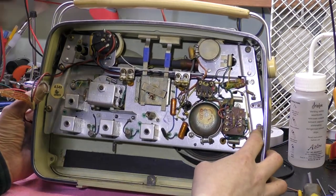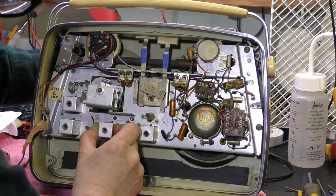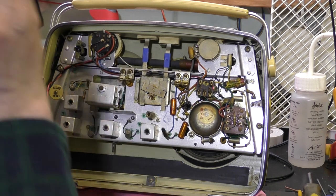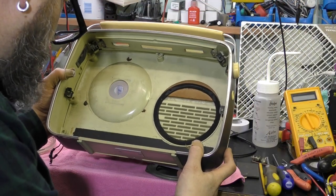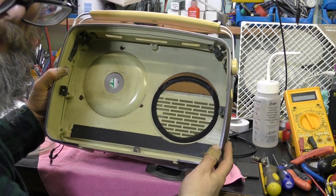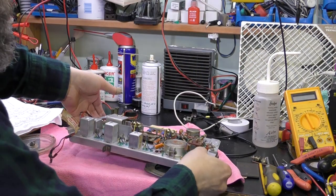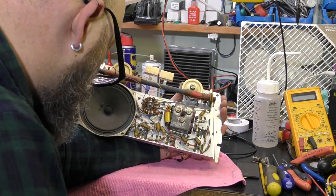There are four chassis screws. The speaker's going to come with it. I better discharge that capacitor before I have an accident. I think the first thing I'm going to do is put cardboard on that speaker so I don't stick my fingers through it. Just pushing the wavechange switches so they were both in equal amount, I managed to wiggle it out of the case. Nice and dirty. There's the felt to couple the speaker.